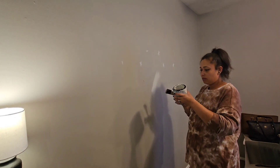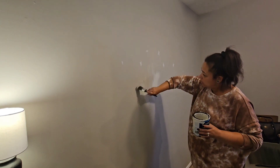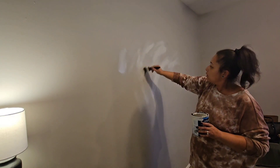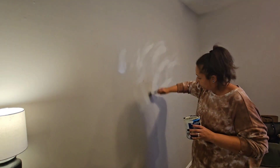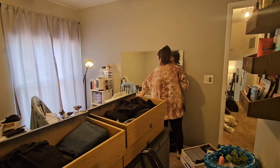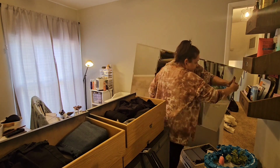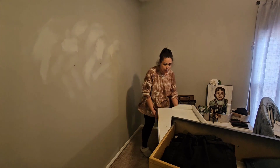My first of two hiccups with this room refresh was the paint. I used the wrong color — we painted this room in our master bedroom in Mindful Gray, which is a little bit darker, but I accidentally used Repose Gray. I checked the can and my brain was just telling me it was fine because I only had one day to get this room makeover done. I am going to fix that off camera. One technique I like to use is feathering it out and then stippling with the brush because we have textured walls, and that textured spray stuff is stupidly expensive — I did not want to go over my under-$100 budget.